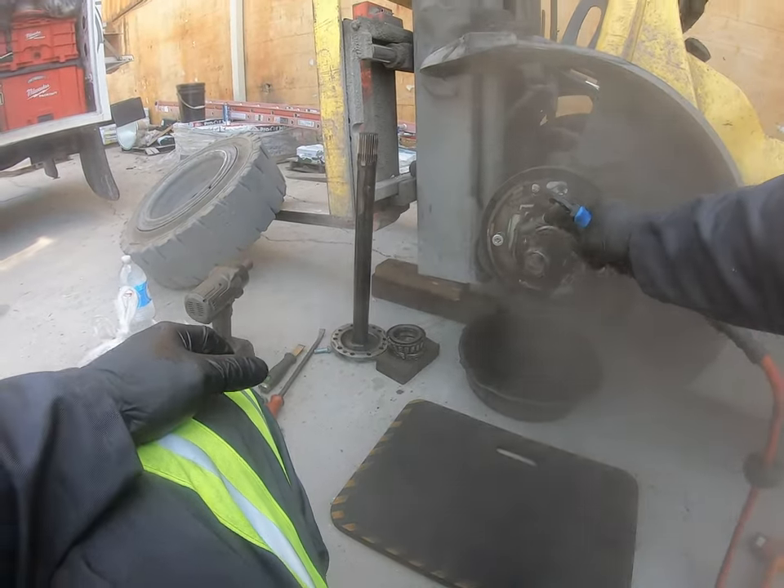It's not really difficult to do a brake job on a forklift, especially when it has a dry system. A wet system is a little bit different, and whenever I do that I'll try to film it too. The hardest part is basically just taking all the springs out - these little springs that hold the shoes in place - and the adjuster screw. You have to take all this out just to get to the wheel cylinder. You replace the wheel cylinder using the nuts in the back, take the brake line out, put the new one in, and then do everything in reverse. Then we'll do the same thing on the other side and clean everything up.